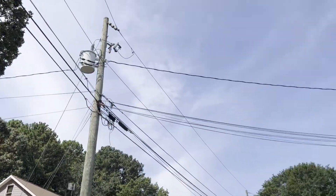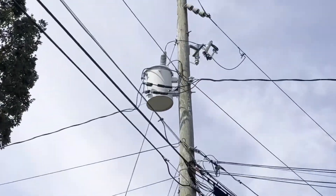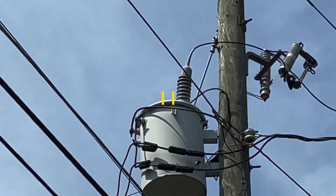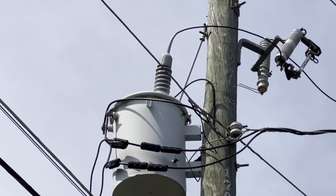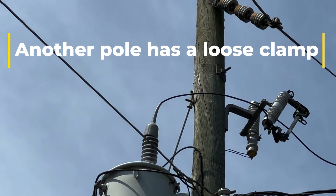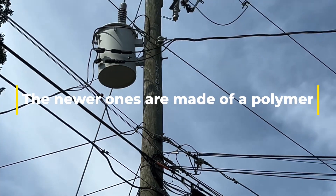This is a different pole. So let me show you a point of reference — there's the pole I was just showing you. RFI Mapper was registering 11 dB or more from this one. You see it's got the proverbial boot there. Now the boot in and of itself is probably not an issue — it's the clamp under it. But there again, you see the lightning arresters to the right, the bolt going through — that's usually an area of noise. And this one's also got old style insulators.